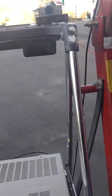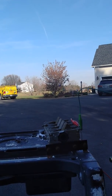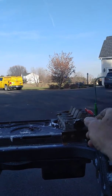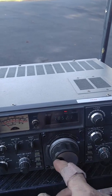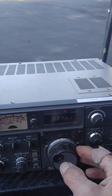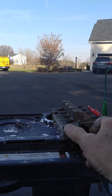Some people like to tune the loop antenna using the noise in the background — if I pull it to a null, you can see just the background noise. And if I change the frequency to 160 meters, our local net is like 1885 — nobody's on, of course, sun's up — you can still see the tuning effect. Higher frequency, less capacity.